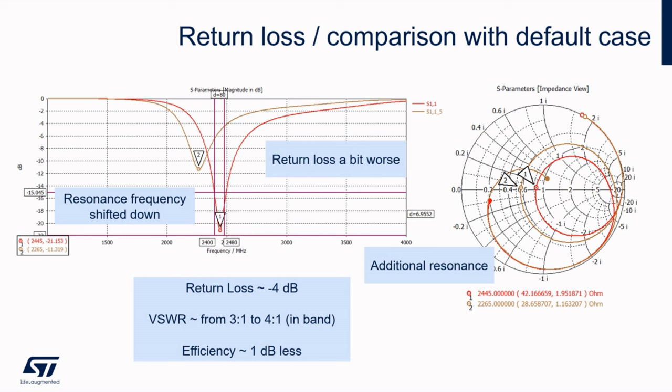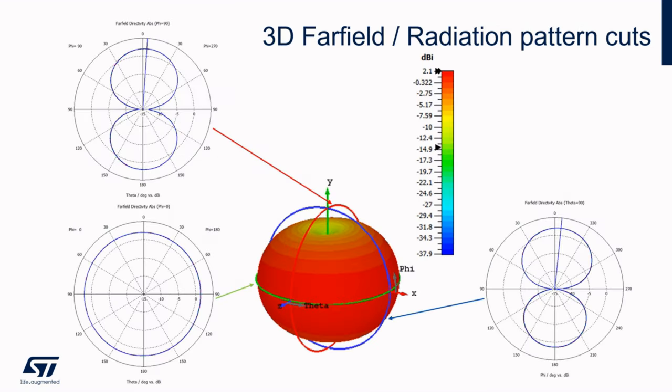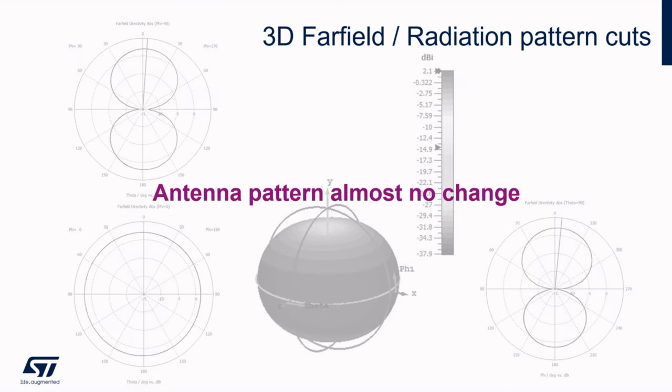In this case it is therefore necessary to consider tuning and/or shortening the antenna for the given type of material and its resulting thickness. The efficiency is a little lower in-band so the losses are not too large, but the question is whether the efficiency on the double does not reach similar or even higher values. So the antenna is detuned a little with worse return loss; efficiency is a bit decreased but nothing critical. The antenna needs to be matched by a matching network or, if possible, the length of the antenna should be changed. When looking at the far field, we can only see unnoticeable deviations from the ideal radiation pattern. We must count on a smaller antenna gain due to efficiency. Except for small deviations, the radiation pattern has not changed — the antenna has retained its omnidirectional character.